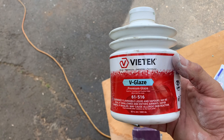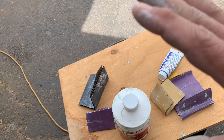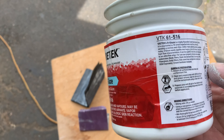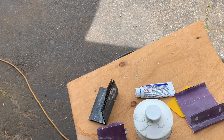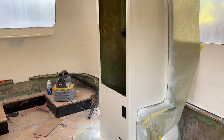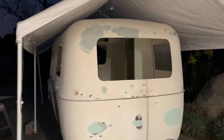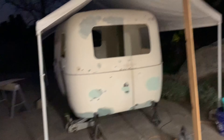I'm filling the minute imperfections — some tiny little bubbles — with the Vitex glaze, so that when I paint this cabinet today in place, all the cabinets will be done. The Vitex glaze is very very smooth — when you put it on, it's just for tiny little pin dots and pinholes that sometimes appear in paint. You mix it up with the cream hardener, hit it with 220 sandpaper, then prime it with some primer in a can. Okay — I just got that cabinet all painted, so now when that dries I can work on the floor.